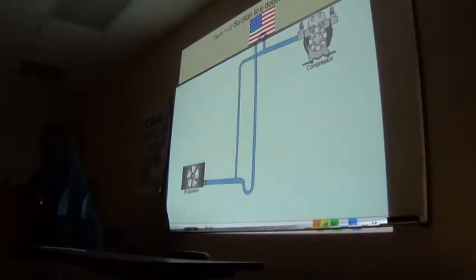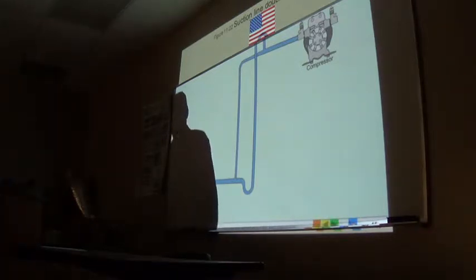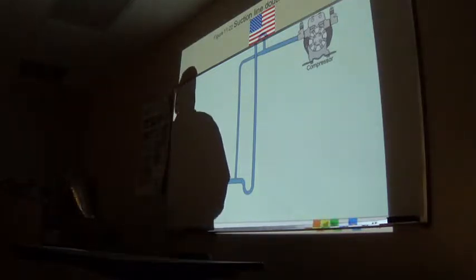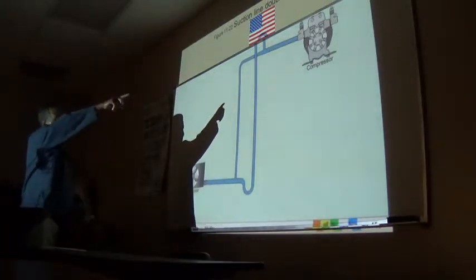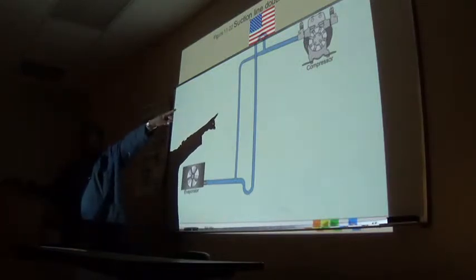And then I need to determine whether I want to decrease that line size or increase, but typically we do not. Leave it the way it is. If the evaporator unit says it comes out to a 3/4 inch line, you want to stay with that, because most likely the line on the matching condenser, if you match it right, will be the same diameter. Should be.